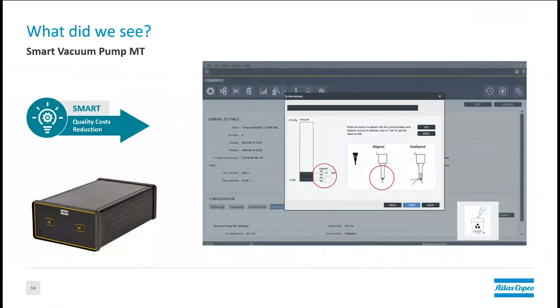We also saw the smart vacuum pump. It's quite compact — it sits off to the side, takes up very little space on the workbench, and plugs directly into the back of the MTF 6000 controller, drawing all its power from there. Through that cable it also provides an interface to the controller so the controller can understand if a screw is properly picked up or if it's tilted. We can send a signal to the robot to go back and pick up another screw immediately — saving cycle time — or to drop a tilted screw and get another one. In traditional applications, if a screw is tilted the system has no way of knowing until it starts to drive it in, at which point you either lose cycle time or damage a part, both of which cost money.